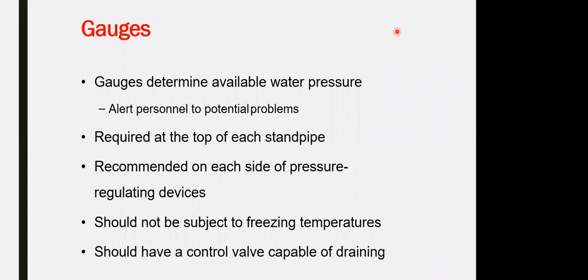If you complete the installation and you are ready for the civil defense inspection, you have to make a completion test and handing over for the system, the pressurized system, and after the flushing, the pressure and completion test for the building. The validity for this test should not exceed 6 months before you submit it to the civil defense. If you are submitting after a period of 6 months from the test time, civil defense will reject it. You have to renew it again.